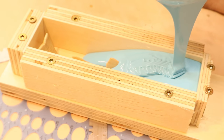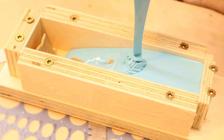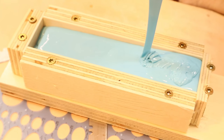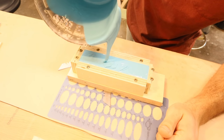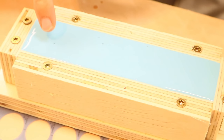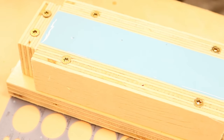That hook slot on the top — I wanted to make sure that filled in before I trapped air inside of it. I shimmed the mold up too, got stencils and razor blades leveling this thing out as best I could. I think 14 ounces was right on, probably could have done with 13. You see little bubbles rising out of the silicone? That's healthy, that's what you're looking for. You don't want those bubbles against your master inside your mold. Hopefully all of them come to the surface. I should not be experimenting with a new silicone while doing something like this — but I am.